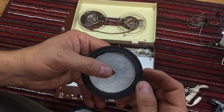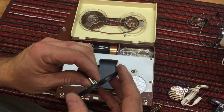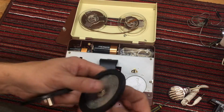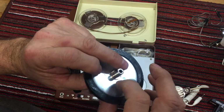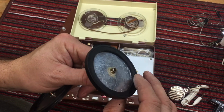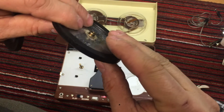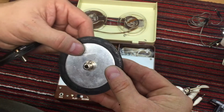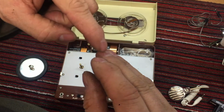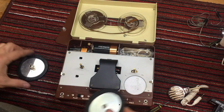And this is so bad and this is so hard, it really surprises me that the tires turn at all, because this rubber is just completely crystallized. Another option, of course, is to break off all of this rubber completely from the spindle and 3D print a brand new tire. But frankly, I've considered that before, and the tire cross section looks like this. And I don't know that I can print a 3D printed tire with that configuration, because there's a notch here, of course, and then this is open, and then I've got this to print. So I don't know. I don't think that's going to work either.